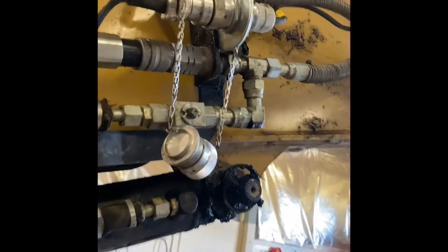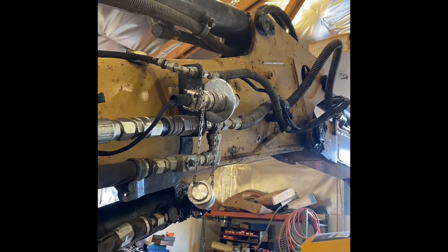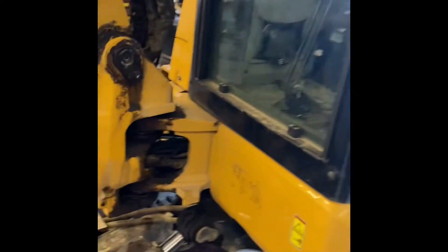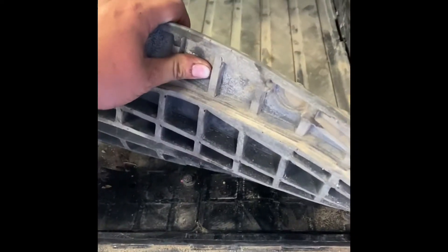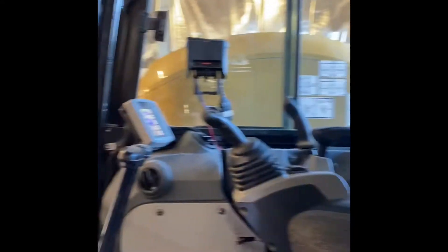We've got our electrical on this side. You can make something fancy if you want — a little quick disconnect fitting for your electrical — but usually we just zip tie them because you're going to smack that off. Sometimes guys like the quick disconnects; we did it on this one. This runs all the way back — you're going to snake it through here. On a mini excavator, you're going to have a body panel under your feet that you can snake it through, then come up and double-side-tape the switch box to the window. That is the easiest way to do it.